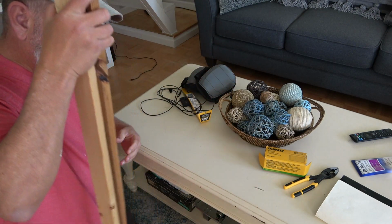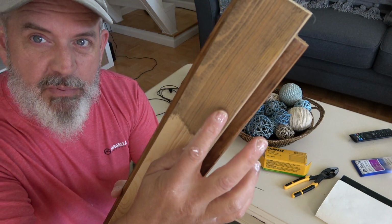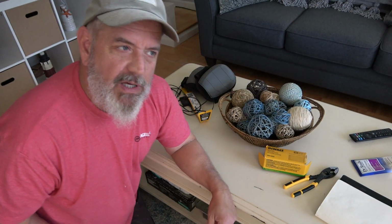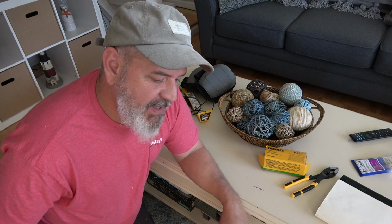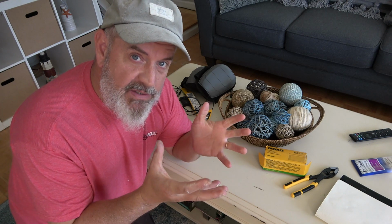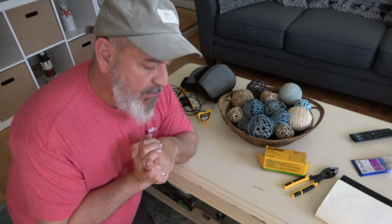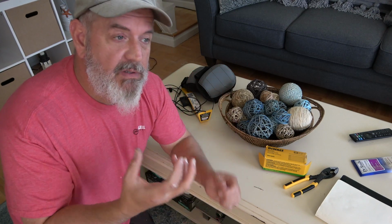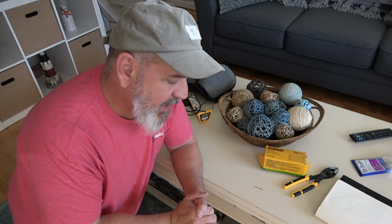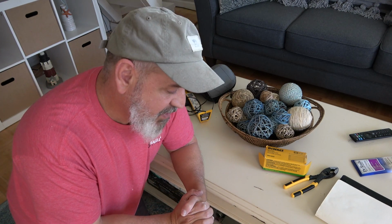Now what I'm going to do is we're going to put down, like I said, a board that looks similar to this, and this is kind of the stain we're going to put down. I'm actually going to use a deck and fence stain. And why is that? It's because I really don't want any shine on those floors up there, and I want them to be able to breathe. There's a lot of humidity up there and there's a lot of heat, so I want the boards to be able to breathe. But if we ever do get any water or any drippings, because there's one roof up there that has the nails you can see directly from the roof, I want it to be protected. But I still want it to be able to breathe up there, expand and contract if needed. So that's why I'm using that outdoor stain.